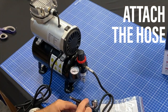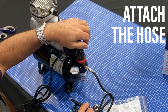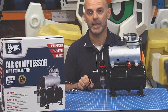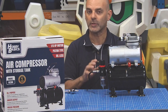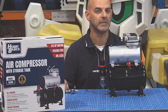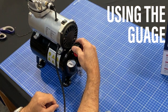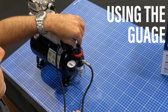If you need to adjust the pressure, it's very simple. Unlock the pressure gauge lock up here, turn it to your desired pressure, and then re-lock. Our next step is to plug it into your power point and then activate the unit. The tank will fill up and then automatically stop when the tank is full. It's quite quiet and shouldn't take too long to fill — it's a 3 litre tank so it should only take a few minutes. We can see the pressure moving and in doing so we've set our pressure to about 10 to 15 PSI, adjusting it with our lock system.